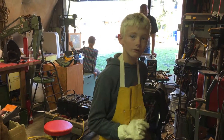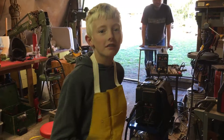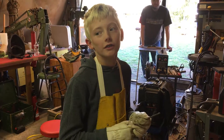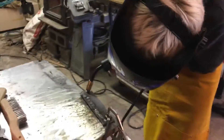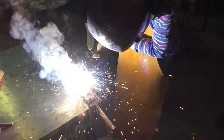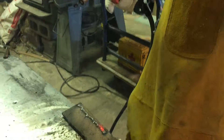How do you prevent birds nesting when you're switching out wire in a MIG welder? Make it nice and straight and make sure all the parts of the welder are off. The torch tip? Yeah, the torch tip. Yep. Nice. You're doing a good job keeping the distance.